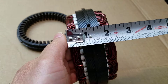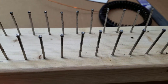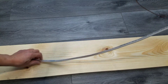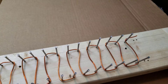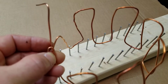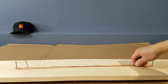The distance between the loop spacing is about three quarters of an inch. I'm using a similar stator coil winding to measure the height of the coil. I transfer the dimensions onto a piece of 2 by 4 so I can build a template for the new stator coil. Here I use a piece of copper wire to build the template — there should be 14 notches total. And I stretch out the copper wire to find out the linear length of the wire, then I use two nails as my markers.